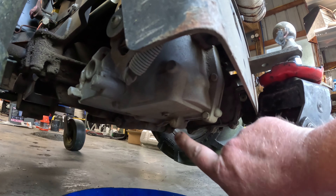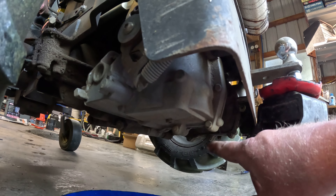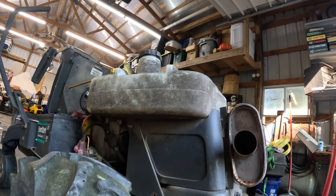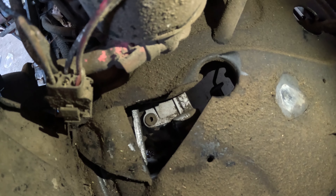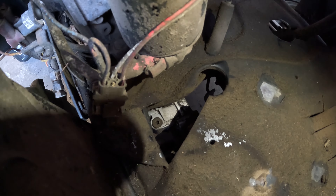Now that I got everything cleaned off, I'm going to go on and grease these pivot points and check all these pulleys — they will have a little play in them, but that's in the pulley itself, not in the bearing. The spindles where the blades are driven from are greasable from the underside, so we'll do those next. I'm working on the bottom side now. I noticed over here the deck has caught something and rolled over, and it's real close to the blades, so I'm going to roll this back up, straighten it out, scrape off all this dead grass and stuff, and then get the grease fittings for the spindles clear and get them all lubricated.